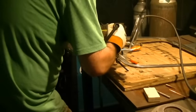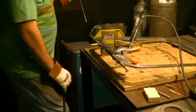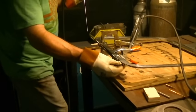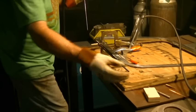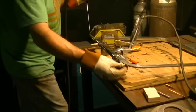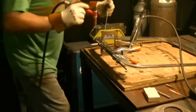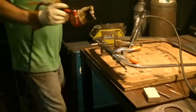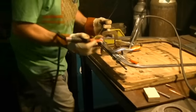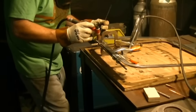Try not to disturb any of this. After the first weld, I like to come in and make sure that the hinge pin is still moving freely, because if it's not, I'm still at a point where it's relatively easy to fix. It's moving pretty good, so I'm going to go ahead and plug the second hole and also fill in the little mistake I made with the drill press. I hate standing up and TIG welding — that's my other pet peeve — but there's just no good way to do this right now.